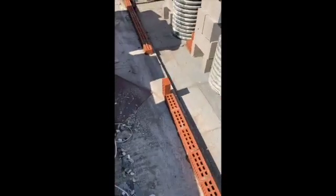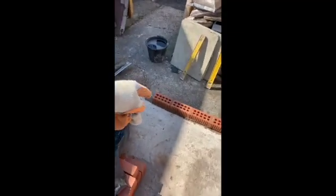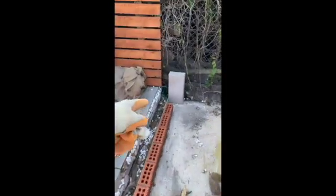So we've got this in. That's the door set out. That's square. That's basically the end where the garage door starts. That's nice and square. Set my line up down there. That's square. Let's work it brick. I'm just going to work it brick. That'll work a full brick. Probably come back about 10mm. Get a brick in there, and then I'll run the line down there, and then I'll square everything up then. Parallel it off the other side, make sure everything's nice.